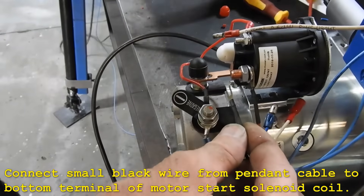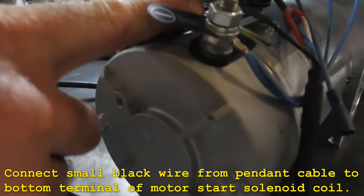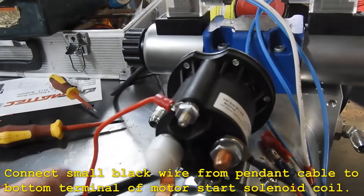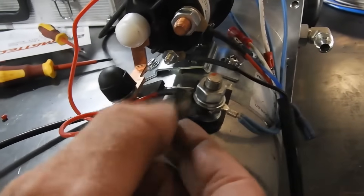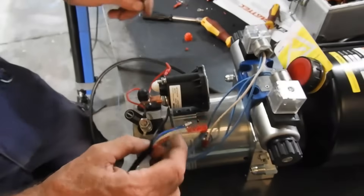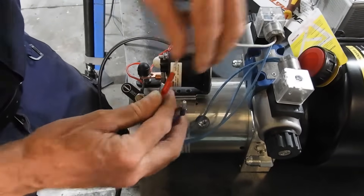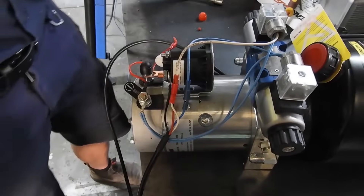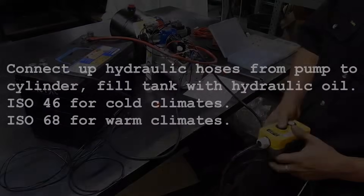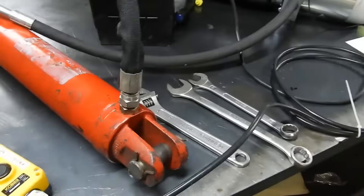The motor solenoid turns the motor on and off. It goes in the little terminal under there — so that's the positive to the solenoid. It goes out the other side of the solenoid, through a thermistor which is housed in the motor, so that in case it overheats it will turn itself off, and then back out of the thermistor onto the negative terminal. That leaves the last two wires, which are the forward and reverse solenoids — you simply plug them in.